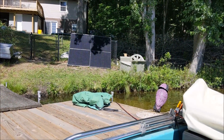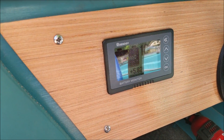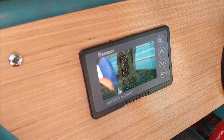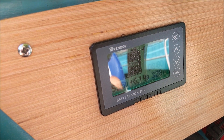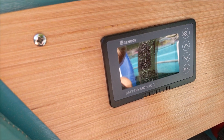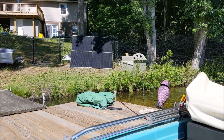I've been letting this run this afternoon — it's a little after 4 p.m., so we're at a slightly odd angle from the sun. But I've been keeping an eye on the wattage output and we've been peaking between 300 and 400 watts — 350, 380 watts — in the last half hour or so. That's about 5 to 6 amp hours kicking in. We're in late afternoon sun at a somewhat sideways angle, but these panels are definitely picking up juice and loading up our batteries.